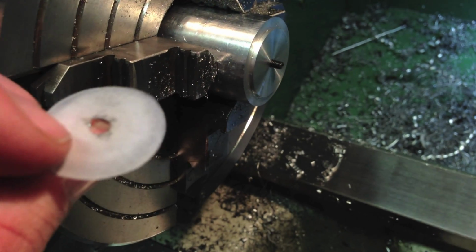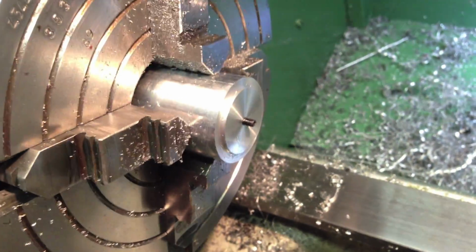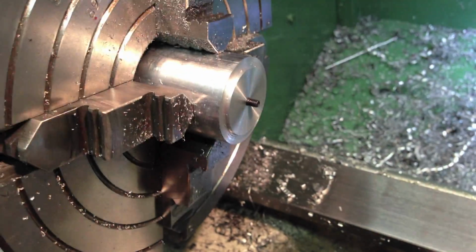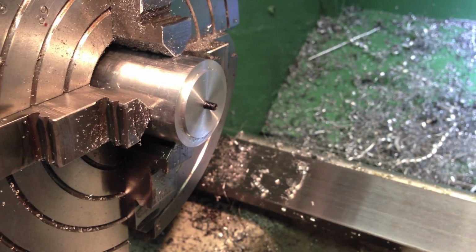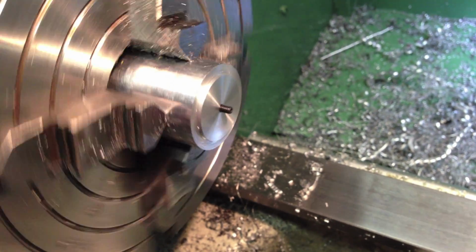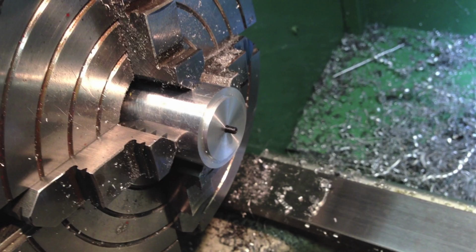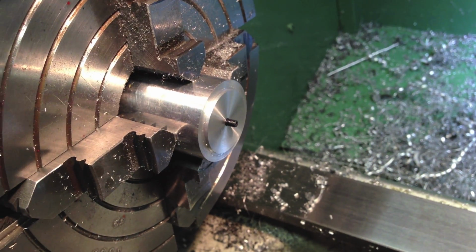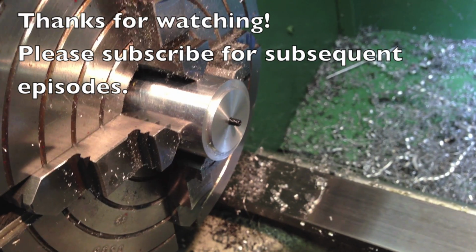If you've seen some of the earlier footage of this saga, you will have known that I managed to weld various parts of the job together inadvertently by galling them onto each other, or by just jamming them onto each other too tightly. I was unable to separate them later, so very careful with that now. I don't want the job to bind up halfway through being made, so that's why I use that oily washer.